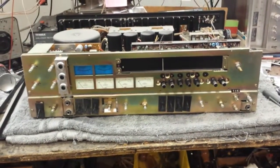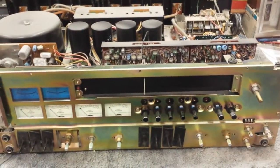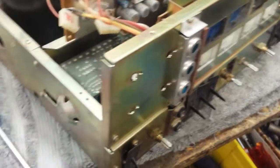So now I'm going to focus on taking the faceplate off of the machine. I'm going to get everything loosened up and then show you how it comes up and away. It may also be necessary for you to cut the wire ties holding the cables that go to the front panels. Although it depends on how they wired it and how much slack there is. I also forgot to mention, you're going to be taking the tone cards out — once you unplug them they just come out. You may wish to mark which one goes on the top or bottom, though it doesn't matter — they're both the same.